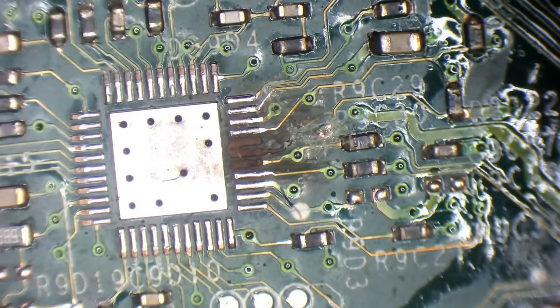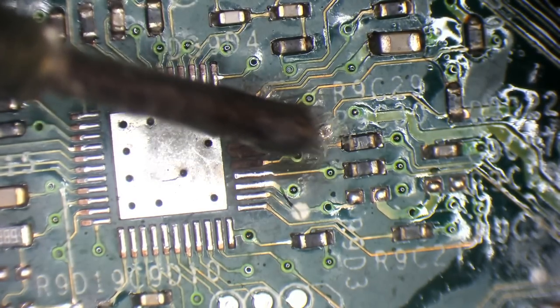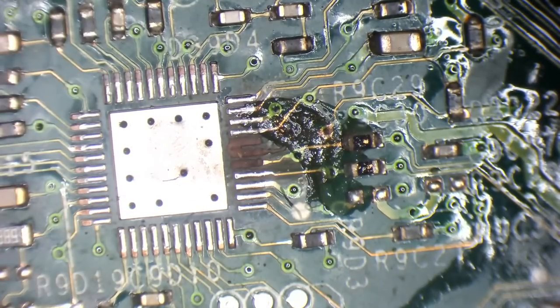Out of interest, Phil, the only difference between the 32 and the 128 gig is 0.1 of a millimetre in thickness. That's the only difference in size. It's the same 153 balls. Yeah, shouldn't be an issue. The only thing you might come across is the amount of current it needs. It's going to draw a lot more current than the 32 and 64. Yeah, makes sense.